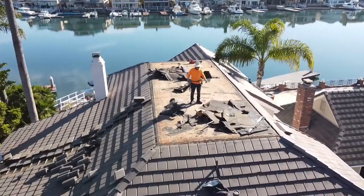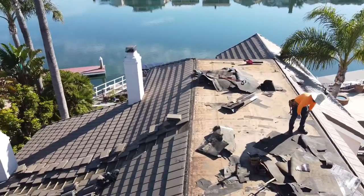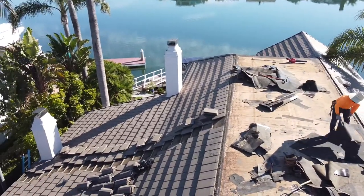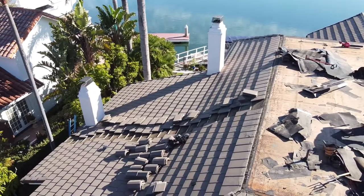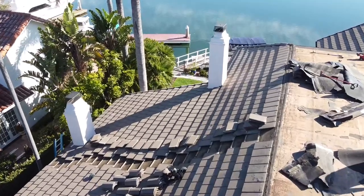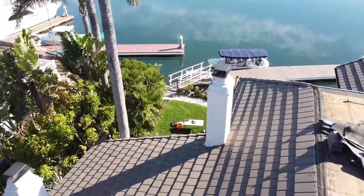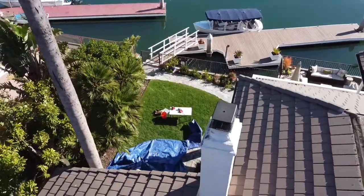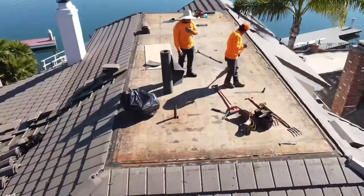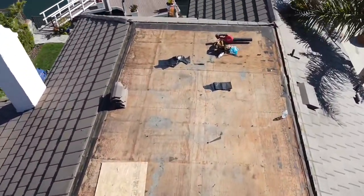Since it was only about seven squares total, our roofing company wouldn't load this roof — we had to do it by hand. There you could see our pathway up to the top. We ripped off the top roof, walked it down, and threw it off into tarps laid over the grass. My shop is only about five miles down the road, so I just threw it in the bed of my truck and into our dumpsters. I didn't see a need to bring the dump trailer.